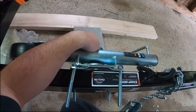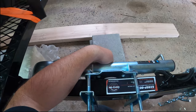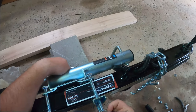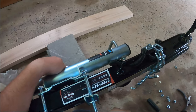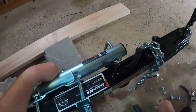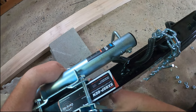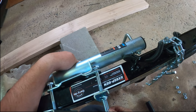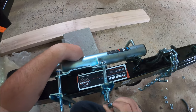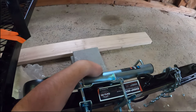We can go ahead and put our brackets over top — there we go. At this point we can go ahead and put these bolts in. You're always going to put in your washer first — that's going to want to roll away of course, which it just did. Whenever you're putting in a washer and a lock washer, this forms a bridge. In case you're unaware, you see these little ridges on the end of the lock washer — that is going to help prevent your nut from rolling off. It won't absolutely prevent it long-term, so we may go ahead and put some thread locker on here just to be extra safe, but it helps to deter that.